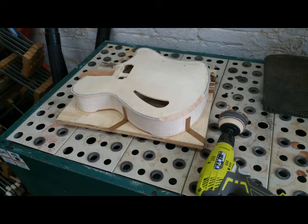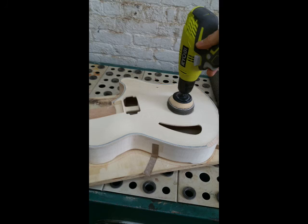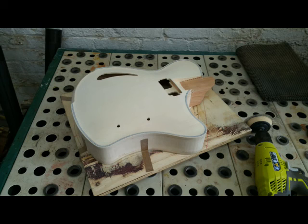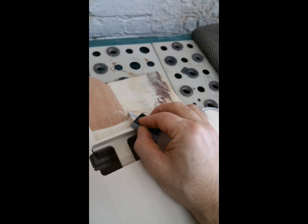Here's the finished body on the sanding table. I'll do a combination of machine sanding and hand block sanding. I injured my elbow years ago doing all block sanding, so I do a lot of the roughing work with that sanding pad mounted in the drill that you see there. It comes with a couple different attachments — one's more firm, one has a foam pad — and that really helps get the roughing out of the way. If you do it right, there's not a lot of cross-grain scratches you've got to fix up. This method really helps; it's not so much to speed the process up, but it definitely saves your arms.